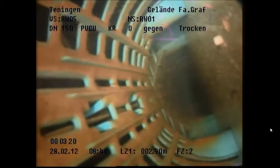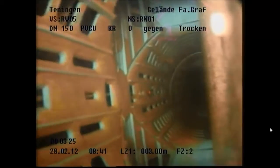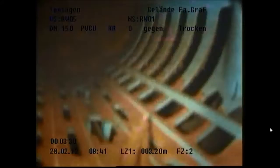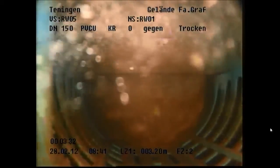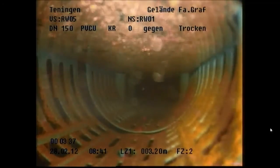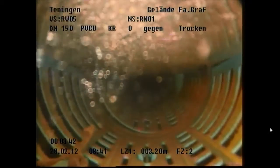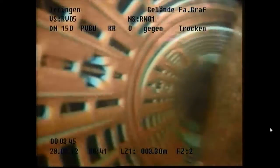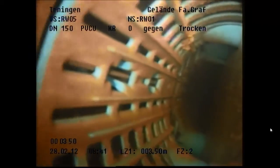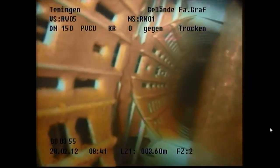These inspectable units mean that you can check what's in there and isolate the position of any blockages and then get to them to remove them. You can either put the rainblock inspect crates throughout the whole base layer of the tank or just in several rows in both directions, so that with a camera you can see throughout the tank to check all parts of it.